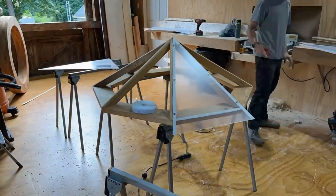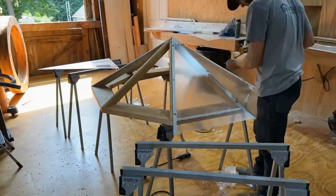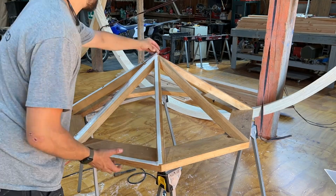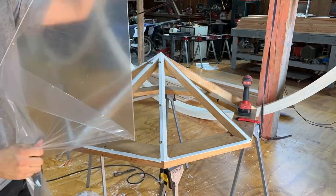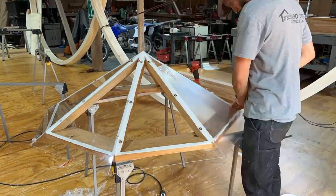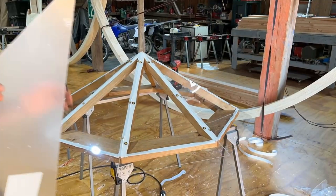Because this is the research and development yurt, I'm experimenting with butyl tape to seal the Lexan to the wood frame. I discovered this product through its RV and trailer waterproofing applications, and it serves an important function. The wood frame and plexiglass panels are likely to expand and contract at slightly different rates. If we fasten the panel directly to the frame, this could lead to cracking and failing down the line. The butyl tape provides a flexible seal that allows for that movement. We also need to overdrill the holes and use washers to give the screws room to move as well.